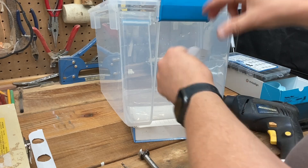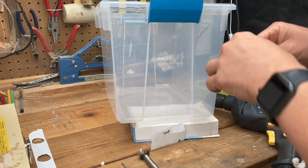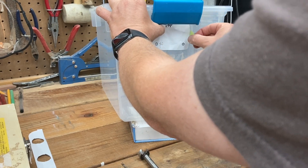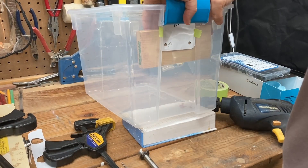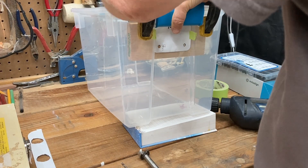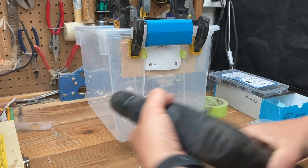First there are some holes that need to be drilled into the ends of the box for the holders for the PVC pipe that the spools hang from. There are some PDF templates you can print out on a regular printer and then cut out, as I did, or you could print them on your 3D printer as plastic templates. I taped the template in place and clamped a scrap piece of wood behind the holes for more support, then drilled out the holes with an appropriate size twist bit.